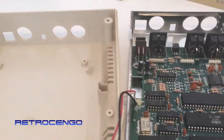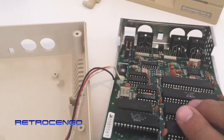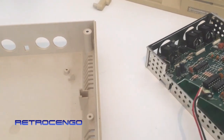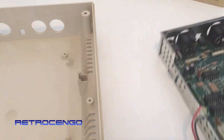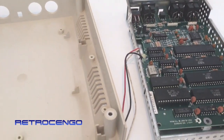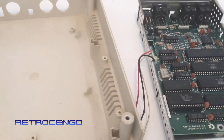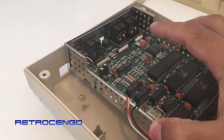This drive has not been fully cleaned. I just removed the dust because I don't know if it works yet. The way I do this is when I get old Commodore hardware, first I remove all the dust and make sure there isn't a capacitor that has leaked, because it's 30-year-old hardware — I do that before I do anything else with it.